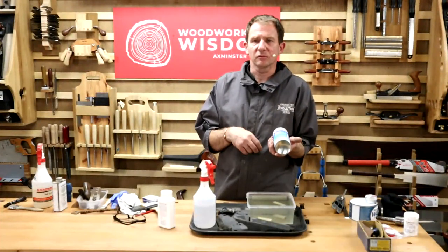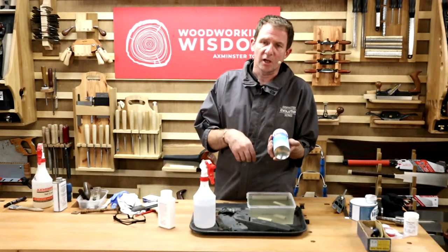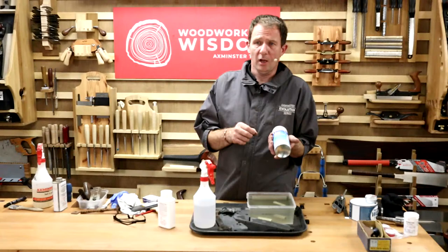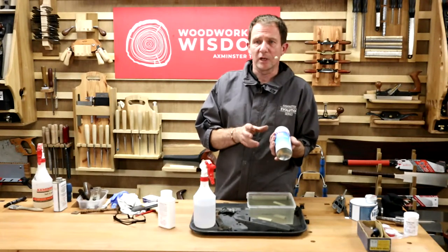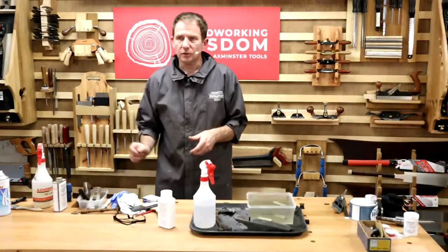Wood dust is a pain, especially on the wood turning side. So you can clean your jaws or take your jaws out, clean the sludge, put a layer of that on. If you've got the open back 100 mil chuck with the teeth that you can see, brush the teeth off, give it a spray with that, will be really good as well. Okay. Craig, you got any more questions? All right, good.